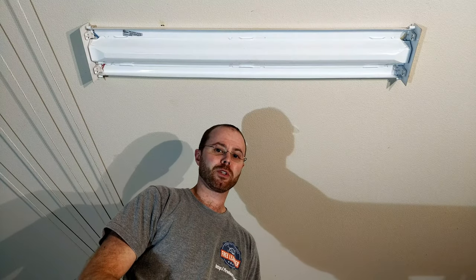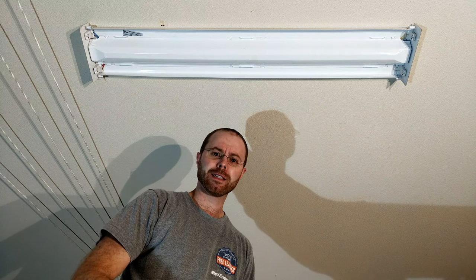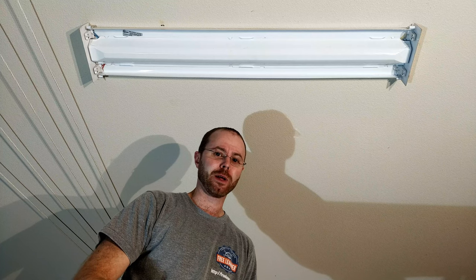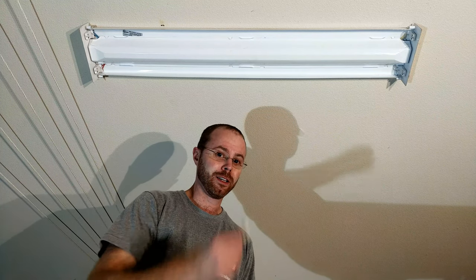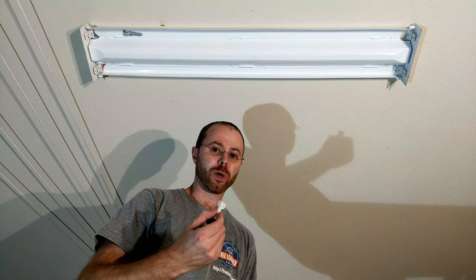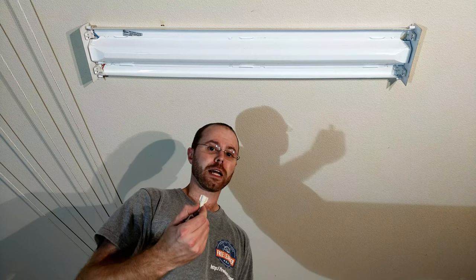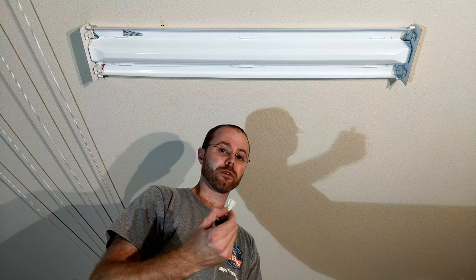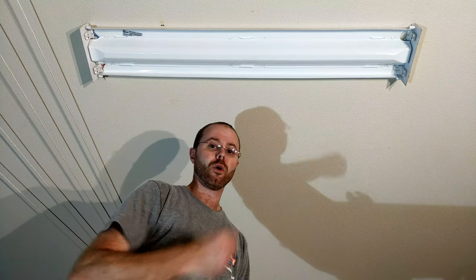In the segment you're about to see, I kept saying 'wing nut' — I don't mean wing nut. What I really meant to say was 'winged connector.' A quick comment on winged connectors: make sure that you have winged connectors that are large or sized appropriately for the number of wires going into them and the gauge of the wire, so that it holds properly.